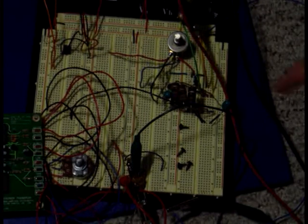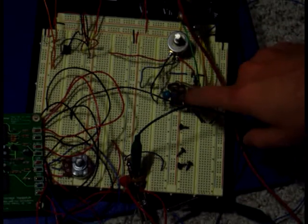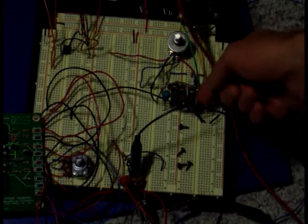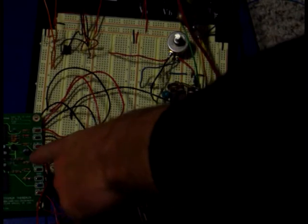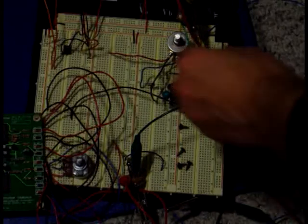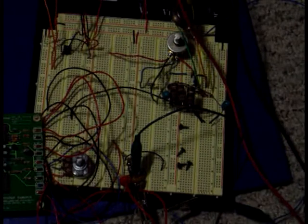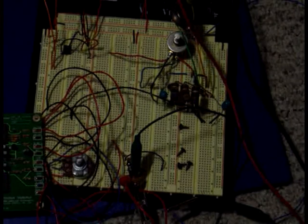And I don't know if you could see it, but these resistors are, I think, half watt resistors. And I was trying to distribute the current through them because they heated up quite a bit. So I had a lot of current running through there, and I was using it to amplify the signal out of the theremin to mixed results. Well, actually, it worked fine. I could vary the gain here from this simple amplifier. But again, I had too much current running through these guys, so I'm cheating today with the amplifier.